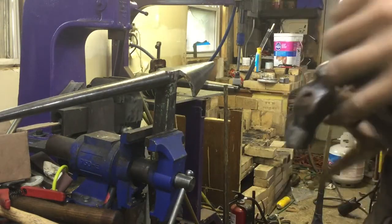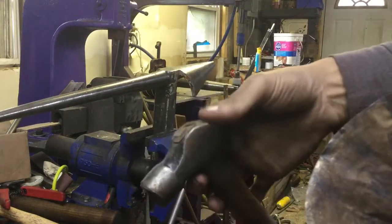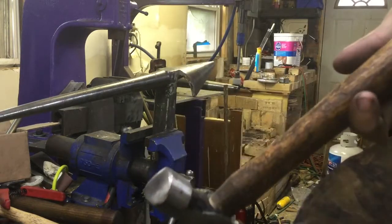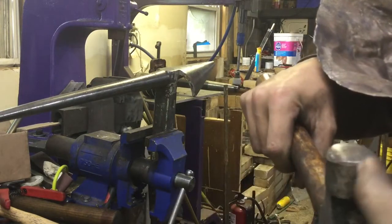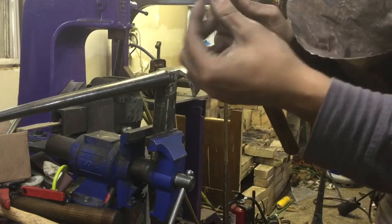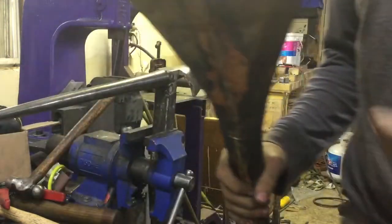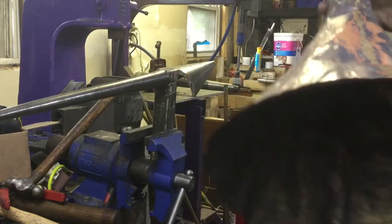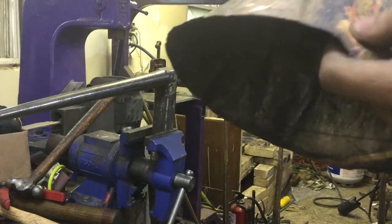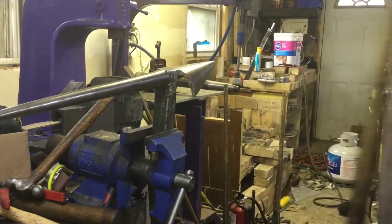You want to make sure it's smooth on the inside and you get that glassy look on the outside when you roll a seam. A lot of questions come in about this hammer — it's the cheapest hammer you could probably buy, a ball-peen from Harbor Freight. I've spent a lot of money on hammers and they all suck, and then I spend two dollars and this one's pretty good. What I did is regrind the face — I put a curve going one direction so when I'm coming down on the bell I'm not digging in the edges but contacting just the strip down the middle. You're looking at the yellow spots where the hammer hasn't touched — you want to hit those raised yellow spots and smooth them out.